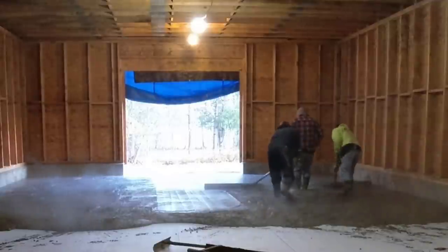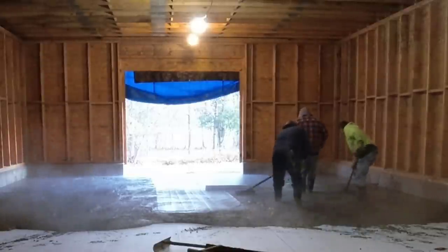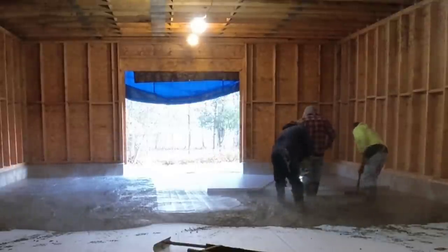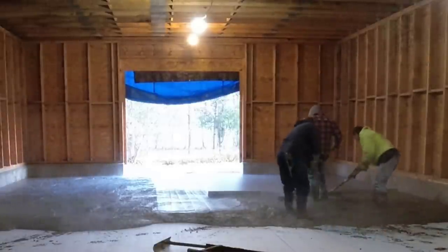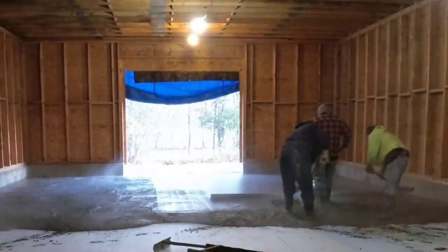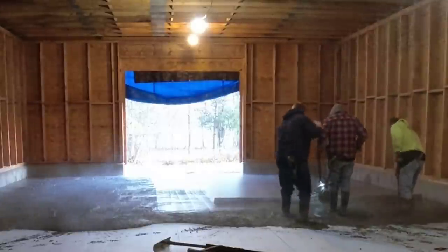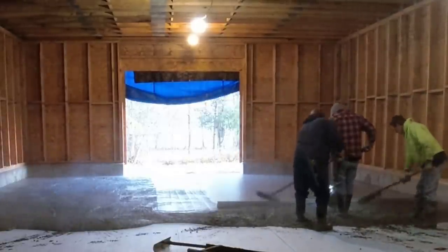You can see all that fog. That's the steam coming off the concrete. That means the concrete's really good and hot for us. Without that hot water in the concrete on a day like today, if you were power troweling this, you'd be here till 8, 9, 10 o'clock at night easily. It just so happens, when this one started to dry, cure, and we put the power trowels on it, we got out of here pretty early in the afternoon, all power troweled, sawed up and everything.